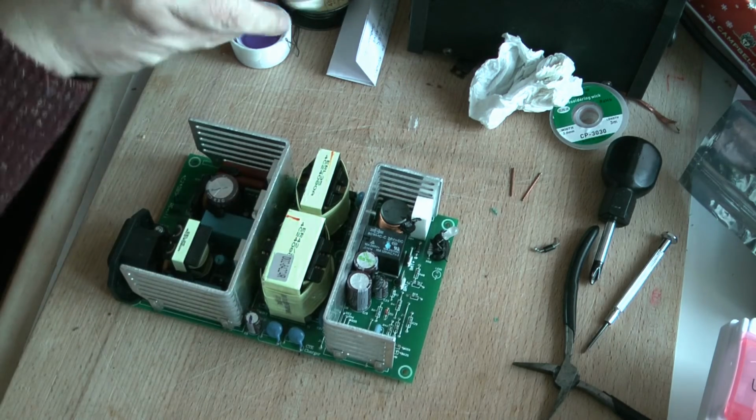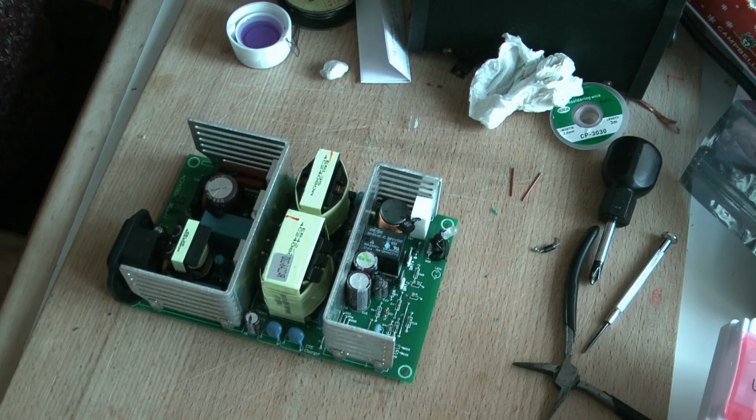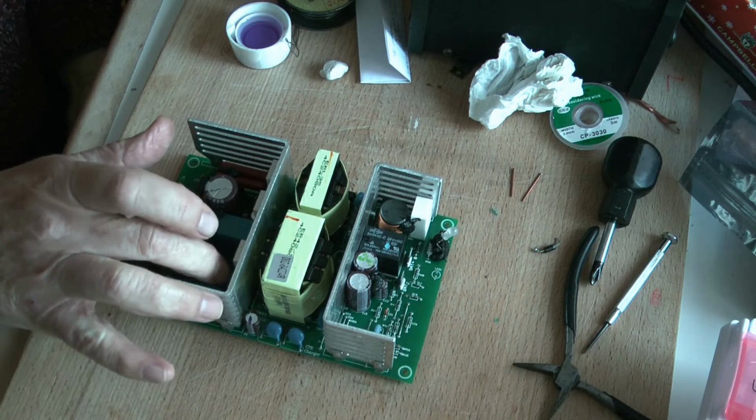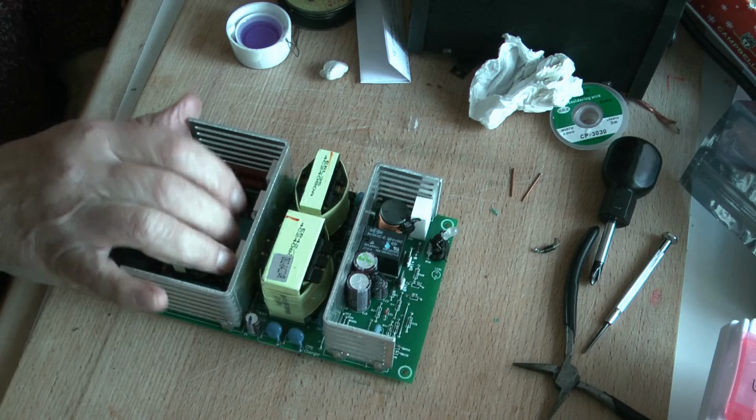On the small piggyback boards that are in there, let's take that out, in there, it's not possible to work out whether the integrated circuits on those boards are fully functional or not, and they may be the culprit for the fault, and if so, this is going to blow up again and it's going to be a little bit costly for me. And if that happens, then I will have to buy the integrated circuits for these little piggyback boards and try them out.